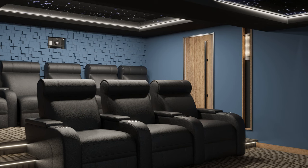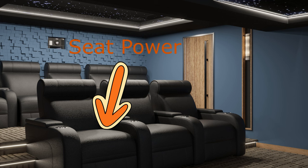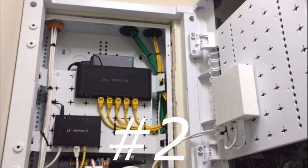If you're putting rear subs in or more subs, put power back there too. Speaking of power — if you're doing home theater seating on a riser, get some power in the risers. Think of anything and everything you might be missing in terms of power, because that's your first step. You don't wire your low-voltage portion, your conduit, or any of the other things in this video until the electrician is done. Get your electrical done first — that's mistake number one.